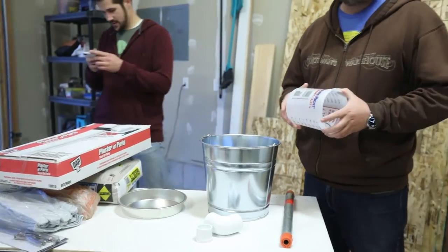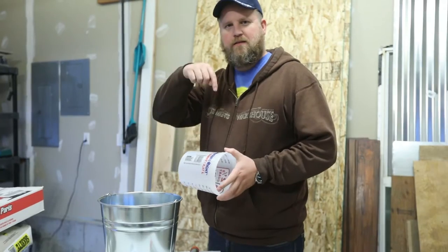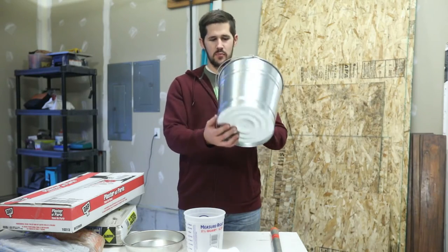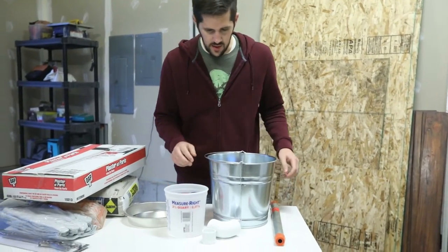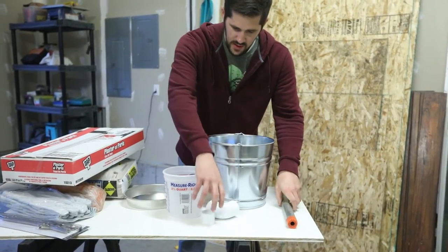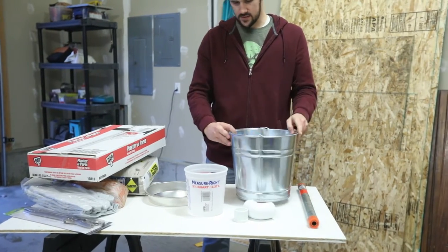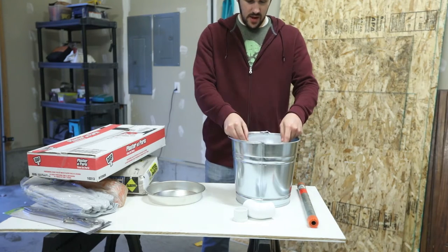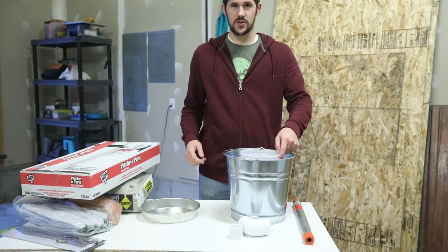We're following the video that Grant Thompson, the King of Random, did. I'll put a link to that in the description. Okay, so what we have here is a 12 quart pail and a 2.5 quart measuring cup, a 1 inch by 18 inch galvanized pipe and some PVC fittings. What we're basically gonna do is fill this pail up with plaster of Paris mix and then jam a cup in here so we can have a nice negative space to light our coals and make our forge.